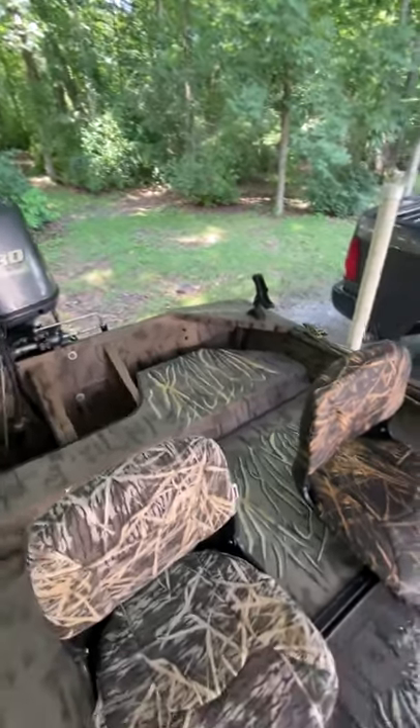The boat runs well. When I first got it, it had an aluminum impeller with an aluminum sleeve from the factory. With just me by myself, it ran about 32 miles an hour with a light load and only about 10 to 15 gallons of gas. With three or four people it'd run about 29 or 30. Then my aluminum impeller imploded — it just broke and came apart. I didn't hit anything or do anything weird; the thing just came apart.